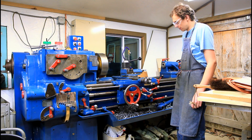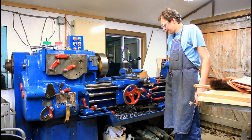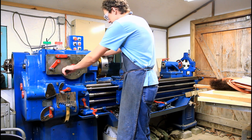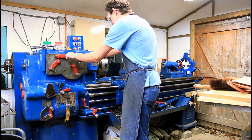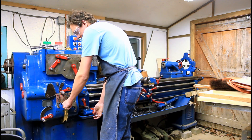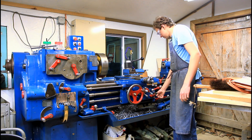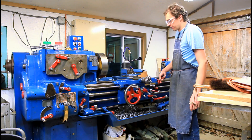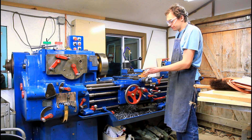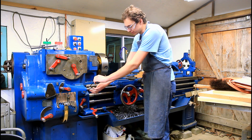As I said earlier, you can engage both feeds across simultaneously — it's a bit jumpy; I've got some binding there to repair. For the lead screw reverse, we run pretty slow — below 140 RPM. This is a 4 TPI thread; you can see we're hauling along pretty good. I can just go back the other way and move through — and it all keeps in time. The other thing you can do is set kick-outs with these little stop collars.